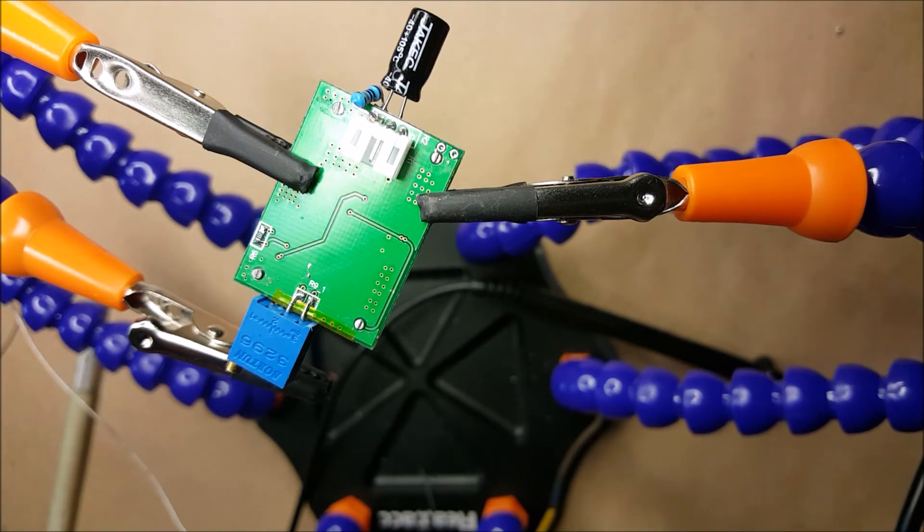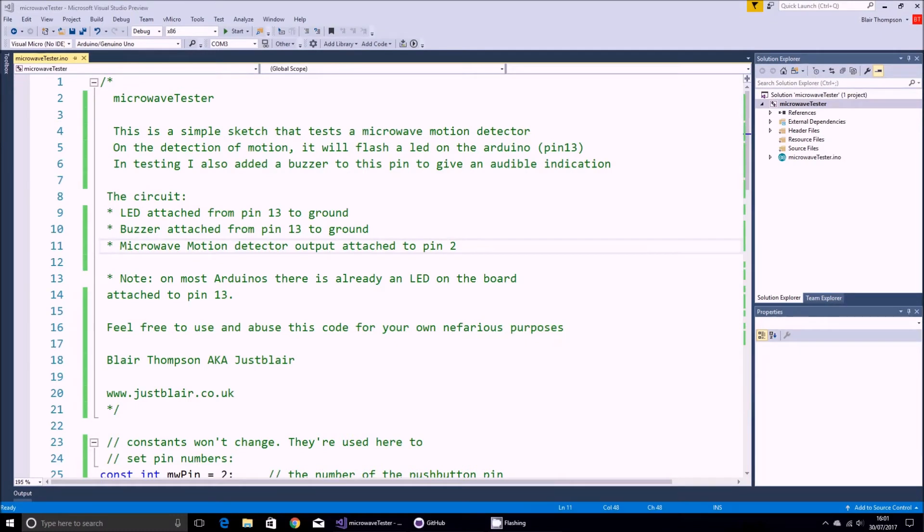What I'm now going to do is a little bit of testing with this device. I've made an Arduino sketch and I'm just going to use it to double-check the range and make sure that everything's working properly. I'll also add a bit of hot glue just to secure everything in place. I'm going to upload a quick sketch onto the Arduino — this sketch is going to help me test the microwave motion detector and also set its range. I will pop this sketch onto my GitHub account in case anybody wants to download it. I'm using Visual Studio to write this, although there's no reason it couldn't be written in the Arduino IDE itself.